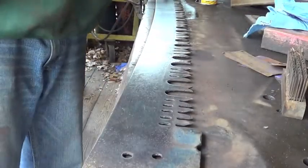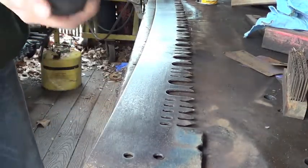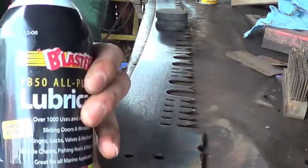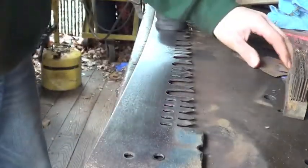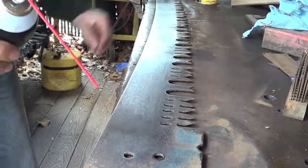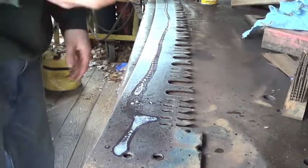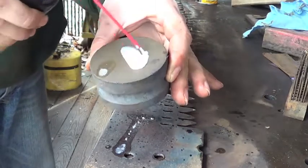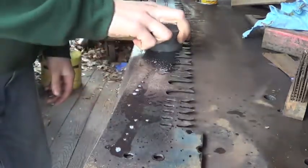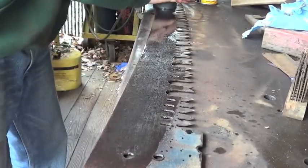After cleaning, this is when I find it appropriate to use your honing stone or axe sharpening stone. Once it's dried off, I take some all-purpose lubricant — though cutting oil might be better — spray some on the saw and on the tip of the stone, let it soak in, and then make strokes along the length of the saw, similar to sanding, to shine it up and remove any heavy scratch marks left by the sandpaper.